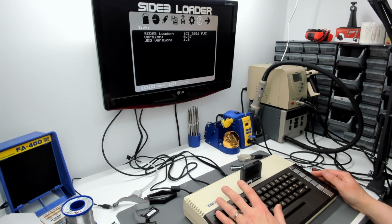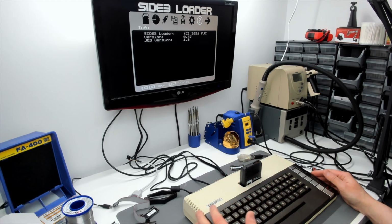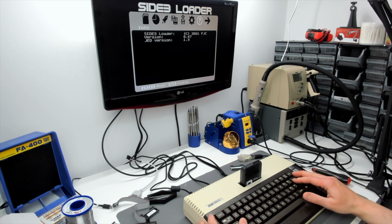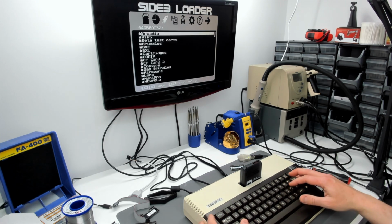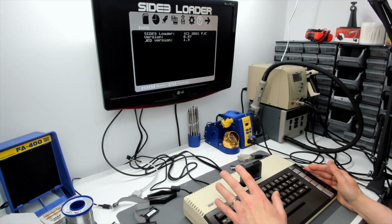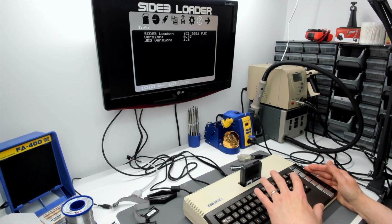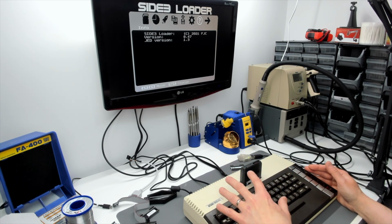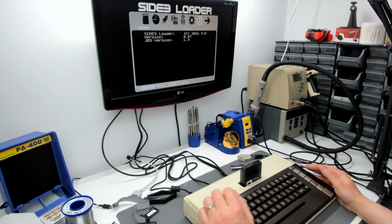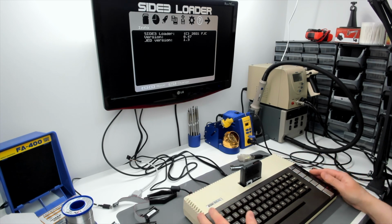So that's why SIDE 3.1 is sold with the older loader, regardless of the fact that people like Peter D. Kaczorowski, he of the O2 Fixer, falsely claim that SIDE 3 stability issues are caused by regressions and/or bugs in the newer versions of the loader. It's certainly true that newer versions of the loader, being larger, more powerful and feature-rich, much more heavily exploit DMA and cartridge ROM banking, and therefore are prone to more quickly revealing underlying stability issues with the hardware, should they exist on the host machine.